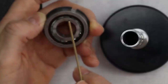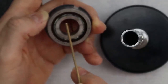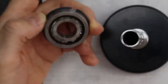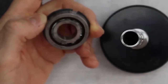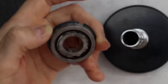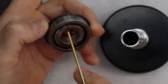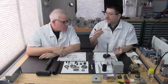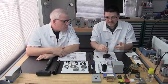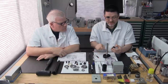The inside bearing race marking is always going to be on the face right here. Depending on the manufacturer, it can be a circle like here, like a letter O. We've seen dots, we've seen asterisks. You'll usually be able to read the little pamphlet that comes with your bearing, and it will tell you the symbol they use. Basically, these identifiers identify the high spots that the bearing manufacturer measured. Like where we measured for the high spot in the spindle and made our witness marks, the bearing manufacturer did the same thing, but they use their own identification marks.